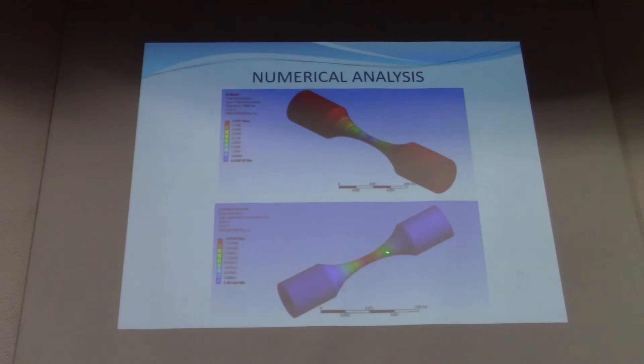At the same time, we carried out numerical simulations to correlate the tip displacement of the specimen with the stress at the center of the ultrasonic specimen. Approximately 30 micrometers of displacement induces a stress of around 200 MPa at the center of the specimen.